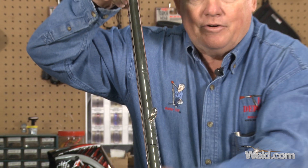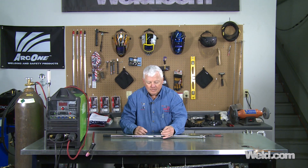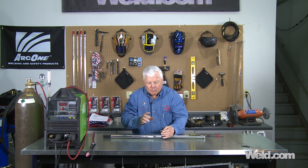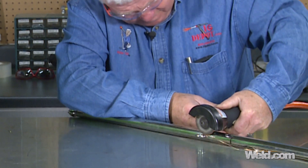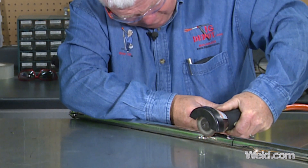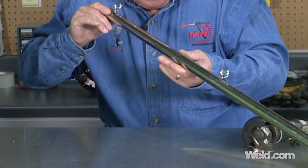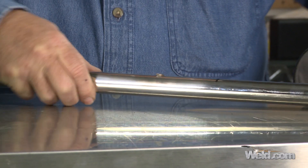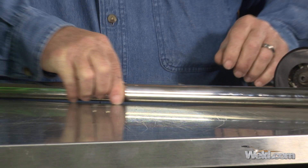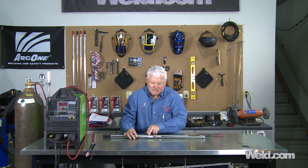So let me get my gear on and I'll start the cut-off procedure. I use the abrasive cut-off wheel, kind of like a slit, and I cut this off. I'm salvaging it — I'm going to weld this one back on with the 316 filler material. I had a little extra material on there, so I had to go up to a belt sander and buffed it off. When I say buff, it puts some scratch marks in there, so it's not as smooth a finish.